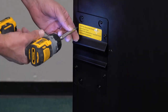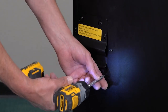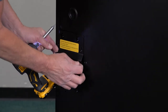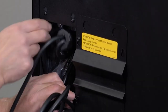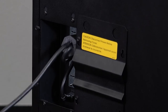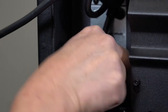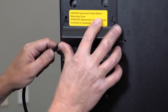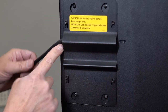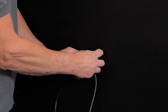Locate the power cord on the back of the machine. Loosen these four Phillips screws to remove the cover and place it off to the side. Now take out the power cord. Make sure the power cord is securely and properly plugged into the machine. During transit, the vibration can cause this to become unplugged. Now place the power cover back on. The power cord goes out through the cover.